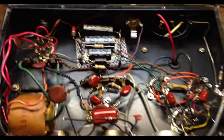There is one design feature in a Hammond AO35, and here's a schematic. And you'll see it on the output here. This little network of a 10K resistor into a 0.0022 capacitor. And this is just across the plates of the two output tubes. And this has the effect of suppressing spikiness. Essentially, that's what it does. But if you want to read up more on it, you can look up Zobel network and read up a lot of the technical gibberish that's out there on that sort of thing. But essentially it's these two components.